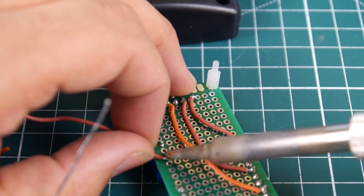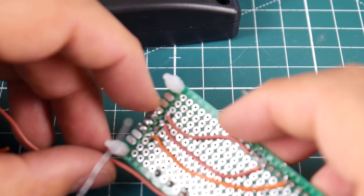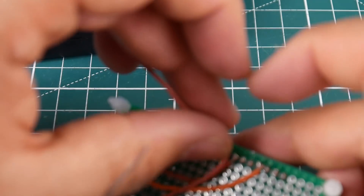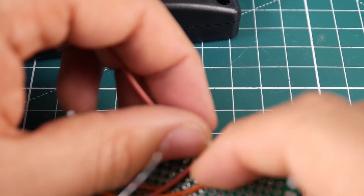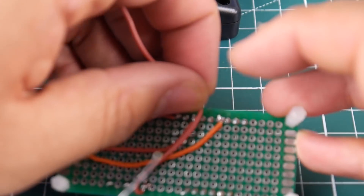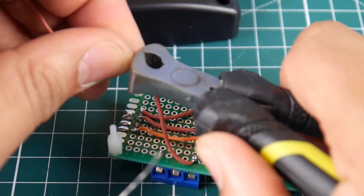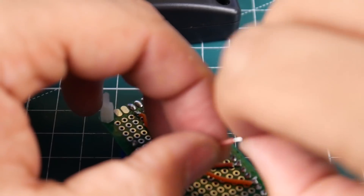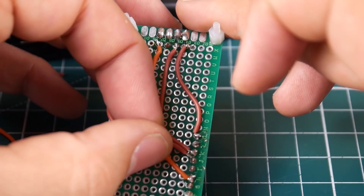The bottom one would be this one. So, we have ground — let's run it to ground. I remember the first one was positive, so this is ground. It would be that one. Should we just ground them together like so? It doesn't matter where you ground them, so let's actually ground these two together. You can ground it either here or up here, but up here is a little tighter space, so I'm just going to ground it down here — about here is good enough. Ground is our third pin down here, as you can see right there. This is going to go in right there, so let's add some solder.